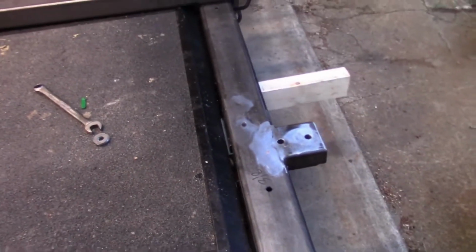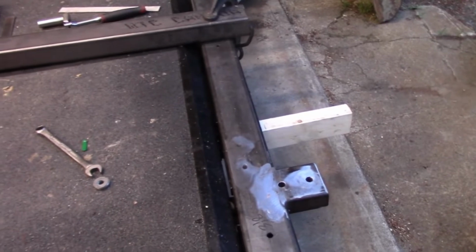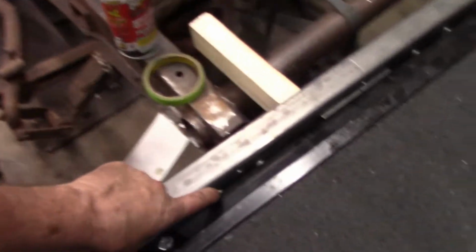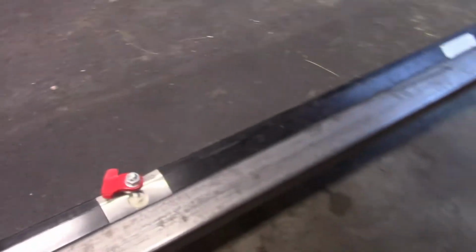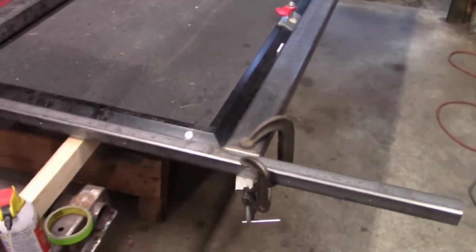The hinges are bolted on. I ended up putting some threaded inserts. They're welded-in bungs. So the hinge is bolted to the cross member. Again, I used the door as a fixture. I've got 1/4-inch shims all the way around. It's spaced up the proper amount for the flange to sit against the frame and the gasketing.